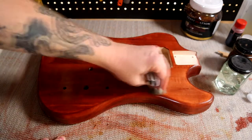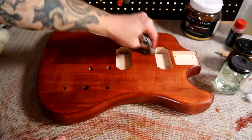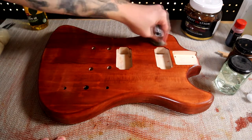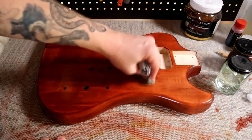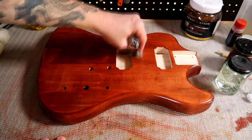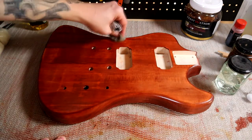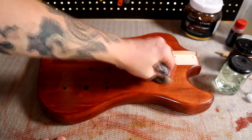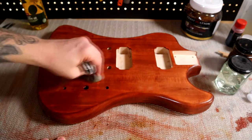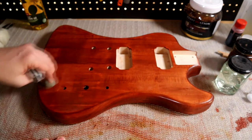The trick is not to stop — don't lift — and you just kind of go wipe back and forward. This takes a long time of just kind of working the shellac into the wood and it builds up over time. So the whole idea here is patience and perseverance.